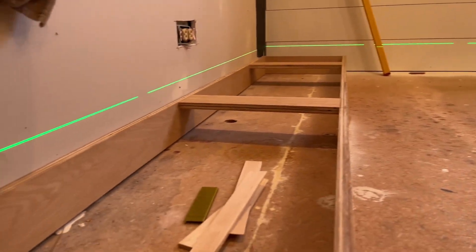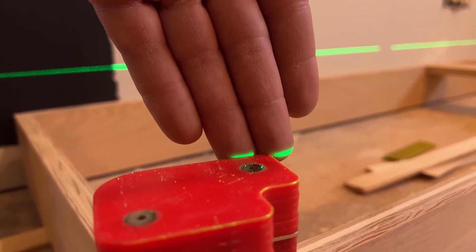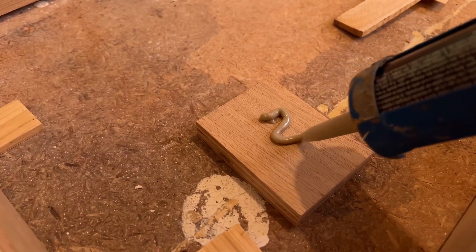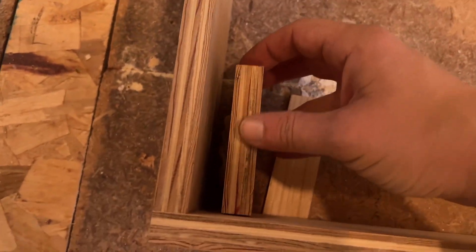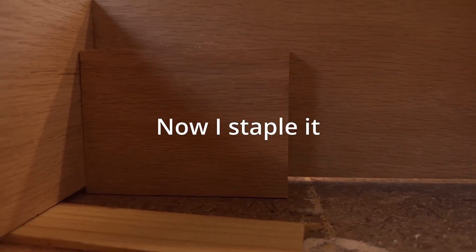Okay, so here's the base that I built earlier — we talked about how I level this. You can see that the laser is obviously higher than the base, so I have this block of shims here. I move from corner to corner and shim each corner up to be aligned with the top of that block. I find the high point before I do this. And here we are just putting a blob of that construction adhesive on there — this is PL Premium X, one of their better ones. It's actually pretty thick; you can see you got to shimmy it around so it'll squeeze down. See it's perfectly flat on the floor — that's why this is such a great way of doing it.